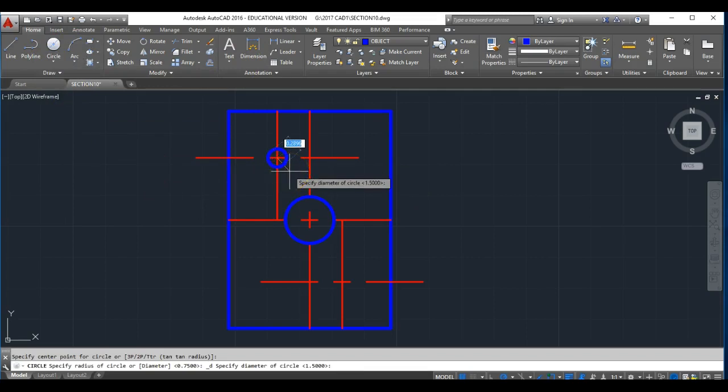Now, these holes are what are called counterbore holes. Basically, you take a smaller drill bit, drill the entire way through, then you take a bigger drill bit and just drill partway into whatever object you're doing. So, on the paper, it's listed as a 1/4 inch diameter through. So that's your smaller size. It goes the whole way through. Then it has this big wide, really fat U shape. It has a diameter of a 1/2 inch. And it has a little down arrow saying 1/8 of an inch. Alright, that's telling me that I'm going to have the bigger circle. It is 1/2 inch in diameter, but it only goes an 1/8 inch in depth.